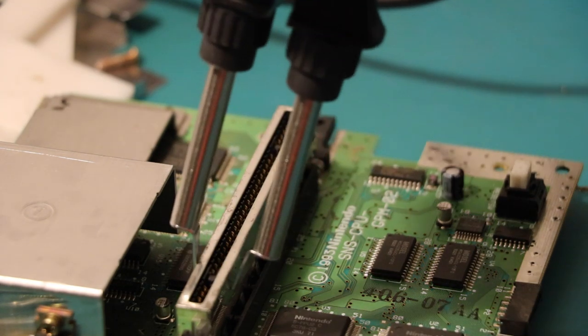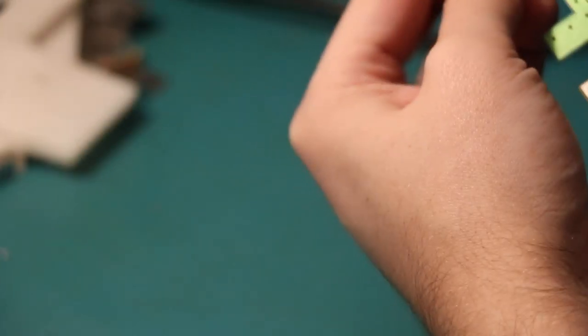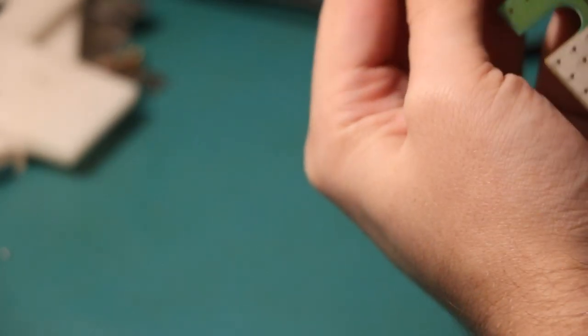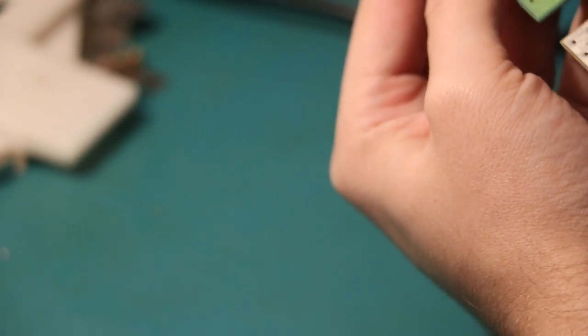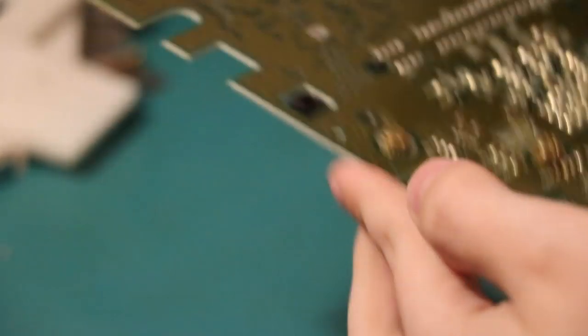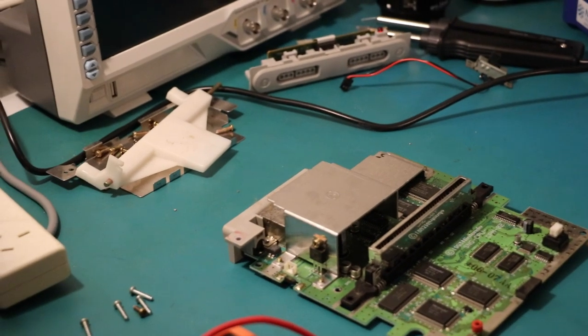Cartridge slot, no problem. There we go. So, have a look at your board. See, mine's got a bit of corrosion on it there. Can't really see anything else. But the good news is it doesn't look like it has been liquid damaged, which is a good thing in my book. So next thing you're going to want to do is remove the metal shielding. We're trying to get to the voltage regulator there.